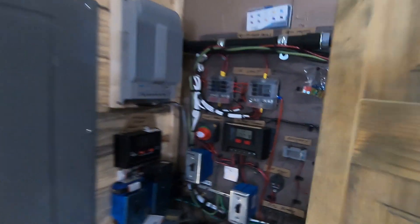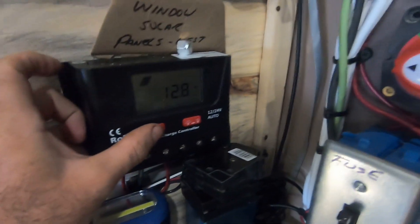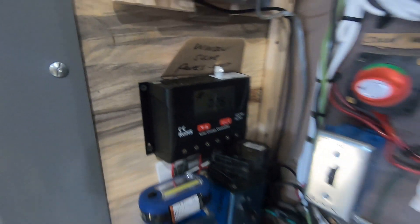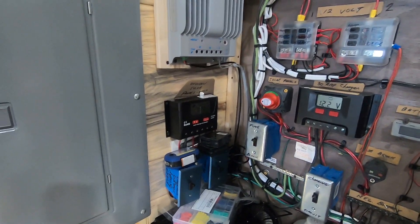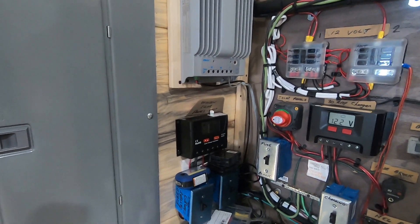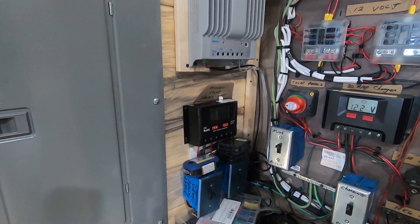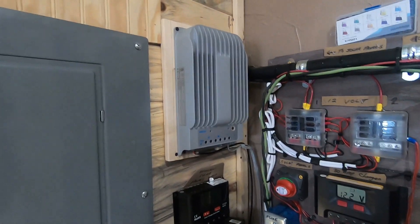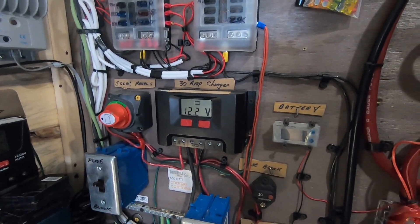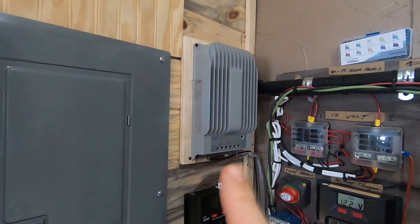Like I said, these are good for about 200 watts and I've got 200-watt panels on this one. You can see the sun's barely hitting those panels right now and it's still charging. I'm going to leave this charge controller. I like knowing what my panels are doing. These are the ones on my sun shields above my windows — kind of an afterthought component system. I put sun shields up and said I ought to just go ahead and put panels on them; they'll give me the last bit of sun in the evening. I want to show you an MPPT versus these cheaper ones and what you get — small system, these are great; bigger system, definitely go with MPPT.